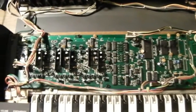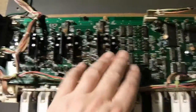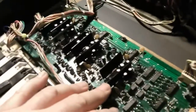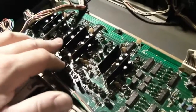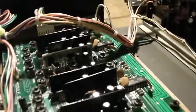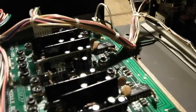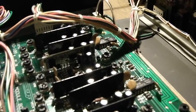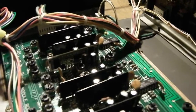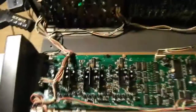Here is the module board you're going to want to take out. You'll notice chip number two is missing. The six chip positions are: one, where two is supposed to be, three, four, five, and six. Number five already has the plastic removed — that was the first voice chip in this synth that started going wonky. I already did this process to that one and it worked beautifully. You take the chip out, throw it in acetone, peel the plastic off, and put it back in.